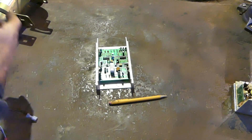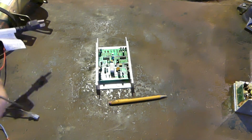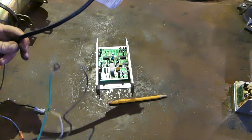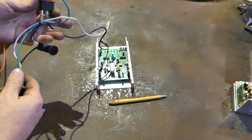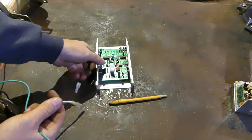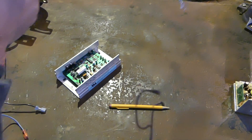So how do you actually wire this up for your project? First thing — when you're ripping apart these treadmills, don't cut the wires. The wires are great. You've got the plug that goes into the wall with a switch and a fuse. You may not use all of that, but the terminals plug right into the board — they're made to fit — so you don't have to do any soldering.